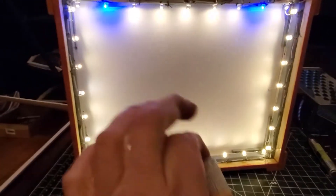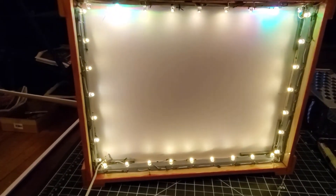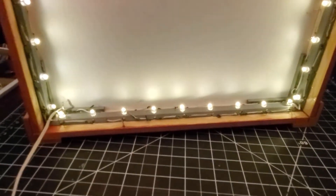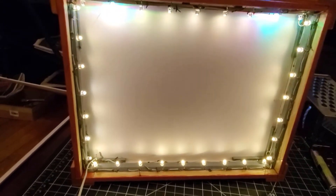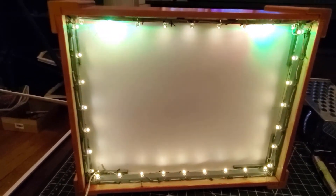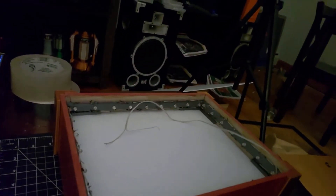This is what it looks like all lit up — you can see the two colors on top changing. This is not how bright it's actually going to be; this little three volt battery is partially dead. I wired a little pigtail in there to tie into everything. I might actually add some more LEDs to the back panel because it could be a little brighter — the bottom isn't as bright as I was hoping. Now I need to make a back panel, and that back panel needs to have a place for the batteries. I'm thinking the foam core board I have here, with a 3D printed strengthening piece super glued to it, and the inside covered with aluminum tape to make it shine more. I'll make a battery box based around simple battery contacts.